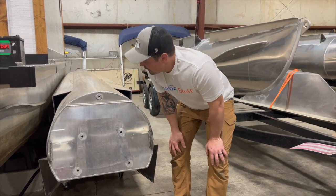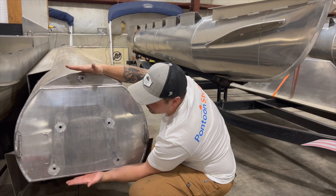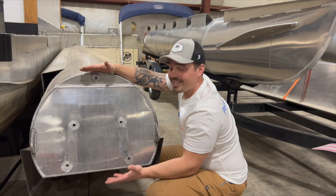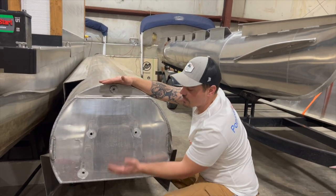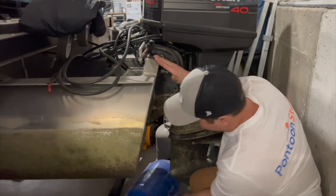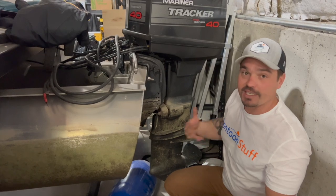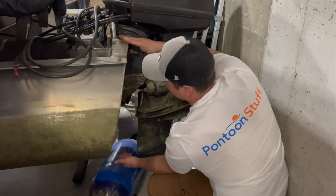One huge thing: if you're taking on this project yourself, you'll want to measure your center pontoon. If it has an integrated transom, you need to know the measurement from the top of your transom to the bottom of your pontoon. A standard long-shaft motor is 20 inches, so you need this to be around 20 to 21.5 inches. A lot of newer center pontoons are extra-long — for example, our houseboat center pontoon off a Bennington measures 25 inches, which is fine for idling but sits too high for performance. Always take this height into account because it dictates what shaft-length engine you need.